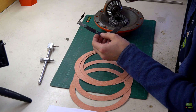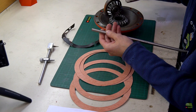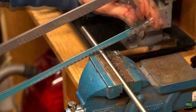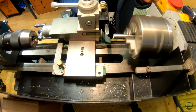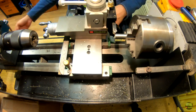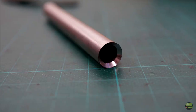So far I've got seals of the right dimensions but I still need holes for the screws, so let's make a puncher. I have an inox tube of 10 mm outer diameter which will be good for M8 screws. Making a puncher is really simple — just cut a piece of tube and align one end on the lathe, then turn it around and cut the end clean. Then use a countersink and cut until you get a sharp edge, so you get something like this.